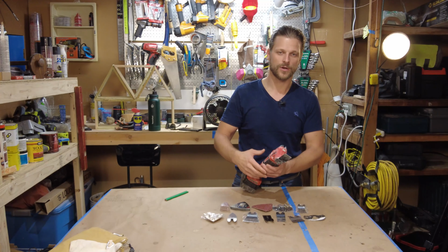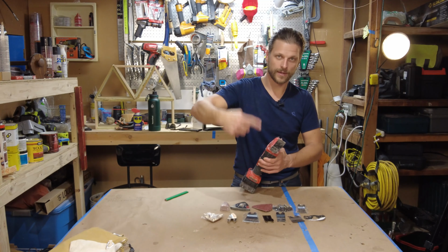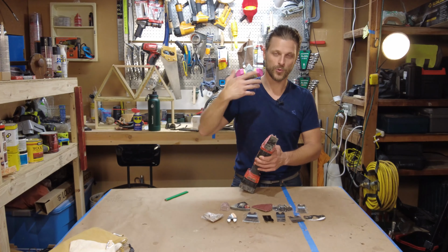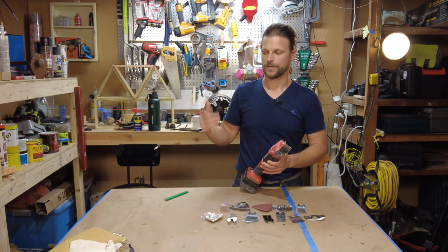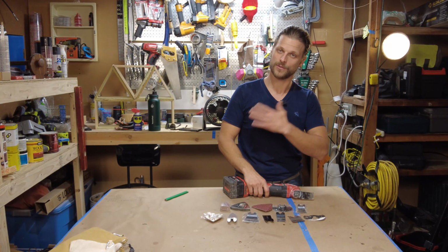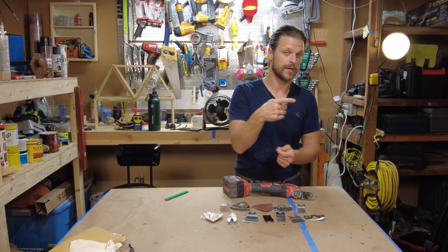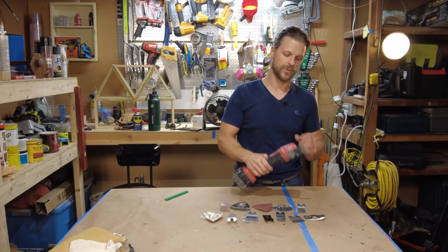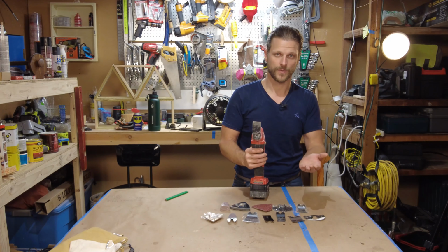So a circular saw, you have a big saw moving quickly, right? So there's a lot of surface area on that blade that is chewing through the material, whatever you're cutting. Sawzall, a little bit less than a circular saw, right? It only comes back about 1.5 inches, something like that. So you're using the same teeth to do a lot of work. With a multi-tool, it's even more. Okay, let me show you.